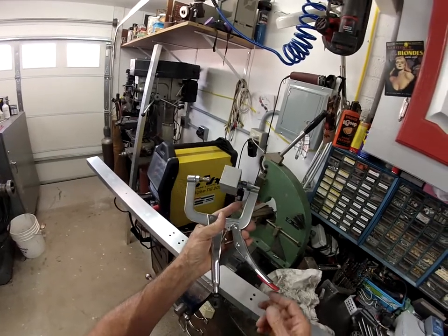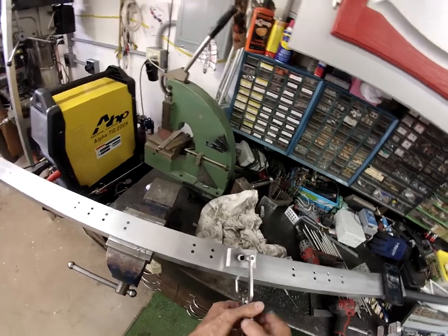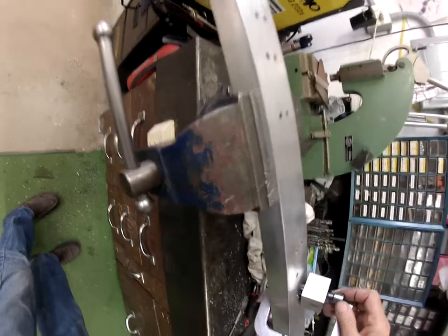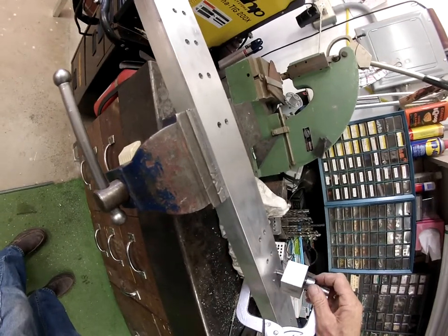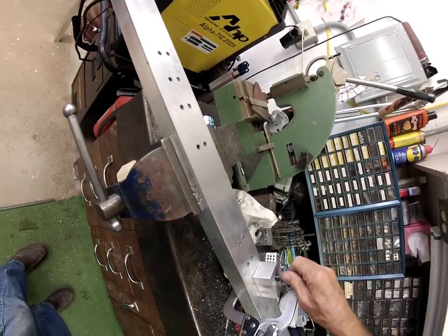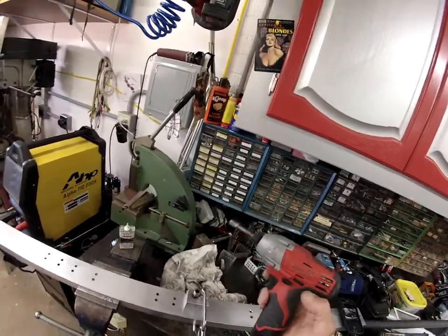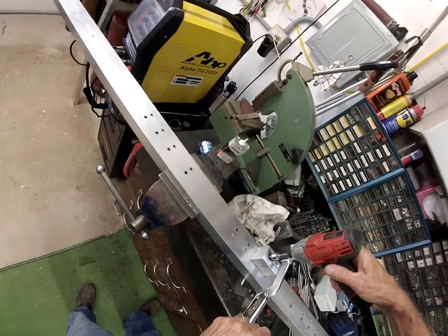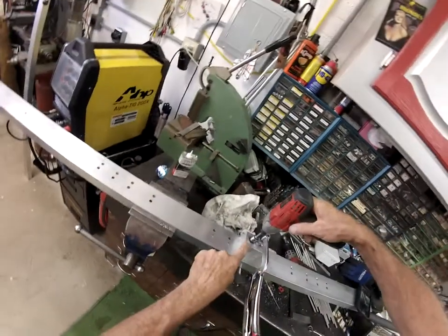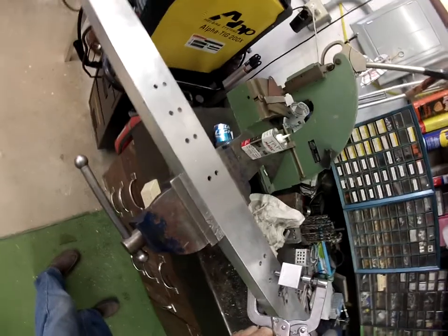To show you how this thing works - to tap a hole, put it on like this and line up the hole underneath. See the tap lined up. Take that burr out of the way, nice and flat, line up the tap, clamp it down, it lays flat. I can even put a little bit of tap magic in there. I take my drill - this is a little impact tool from Milwaukee, a little 12-volt job - put it in there and watch the depth. Now I know exactly what the depth is. Back it off, boom, next one. Thing works really slick - put it on the next hole.